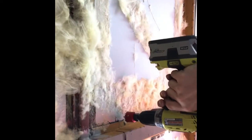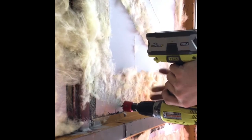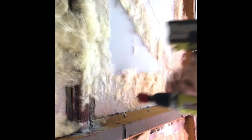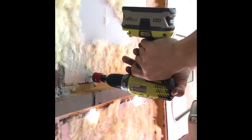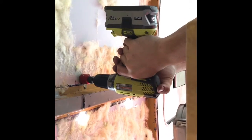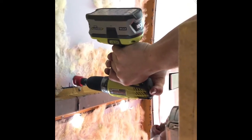I'm going to drill these holes in here on the other side of this, and then I'm going to take my reciprocating saw and cut straight over. Always wear your safety goggles when you're doing this because metal shards are going to go everywhere. Be sure you have anything that you don't want metal on covered up. It was just that easy to get through there. I'm going to finish by putting another hole on this side, and then I'll get my reciprocating saw and cut from here to there.